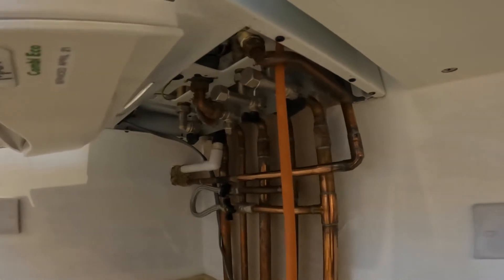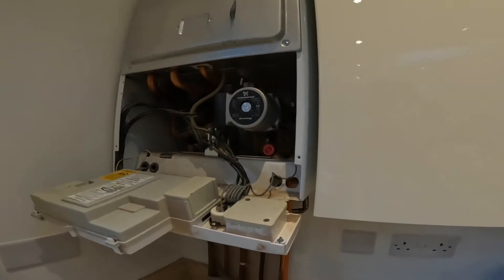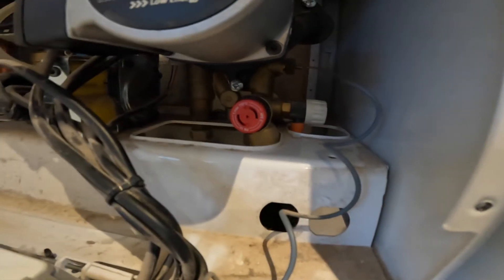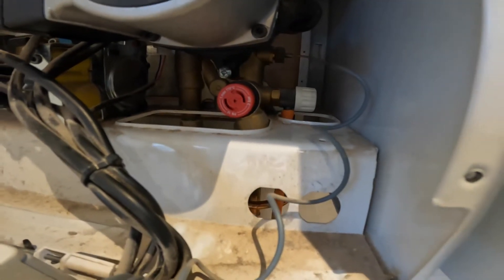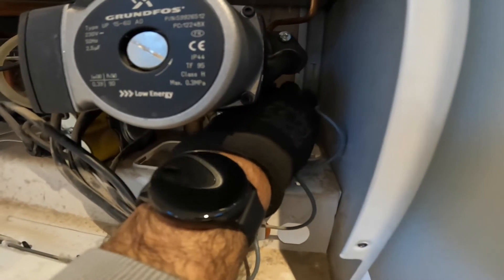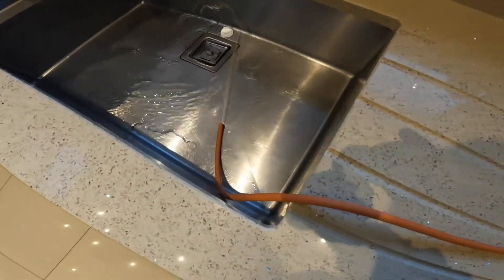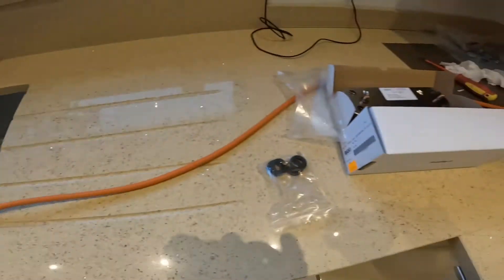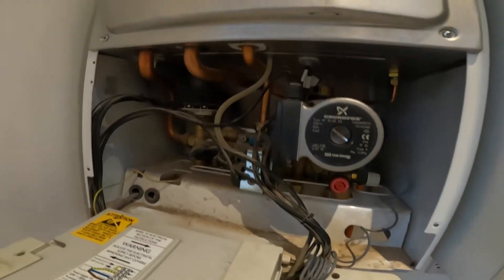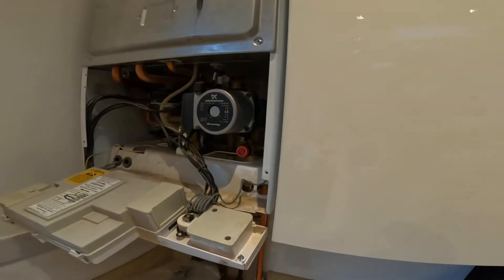Turn the mains water off — you can also turn it off here — and then drain the system. Get the rubber drain pipe connected to the orange pipe, into that valve, open it up anti-clockwise. There you go — draining away into the sink. Let all the water come out from the expansion vessel and the heat exchanger, and once it's all done we'll take it out.